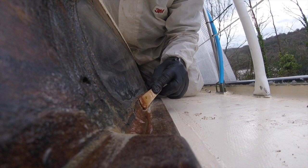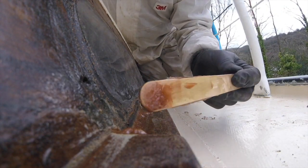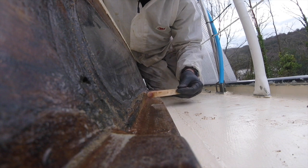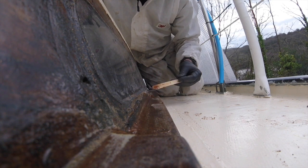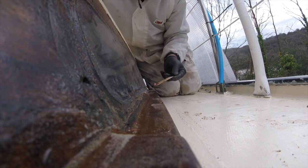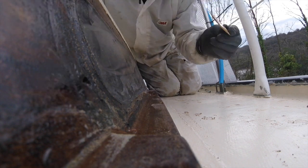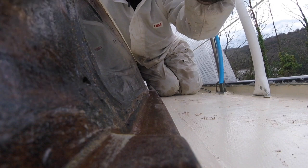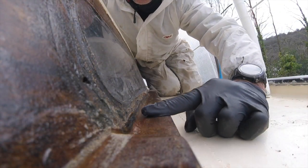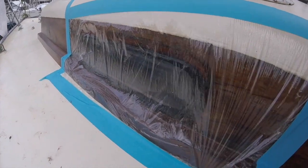And here's a bit of stained epoxy which initially I'm just going to work in there, and then I'm going to smooth it off with my finger. And it will be hardly noticeable, because this should not be leaking now. The point of this mission was that it shouldn't be leaking. So if I go back in the water and it is leaking, I am not going to be a happy bunny. What I may do in disgust is just fiberglass over the whole epoxy thing. And I think you'll agree that is a fairly tidy job. Cling film is your friend - it'll keep the damp off, it'll keep the rain off, until that goes off. Perfect.